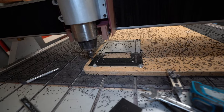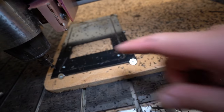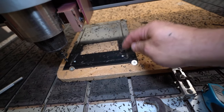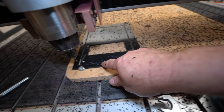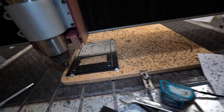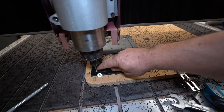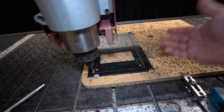Boom. Now here is the result. I think we are okay, but I will not do the chamfering with the machine, big no, because of this half millimeter error. I'm not sure if the 1 millimeter chamfer I planned in Fusion will be enough to do the chamfering on the side, and if we have other hidden code, then maybe I can destroy and demolish my chamfer tool. So definitely I have to look at the post-processor in the Fusion software, what's going on, why I made this one, what is this error here? Or maybe I did a wrong setup in the software, can be, no problem.